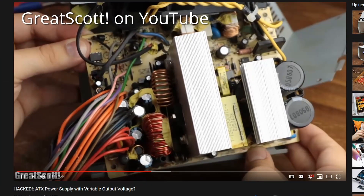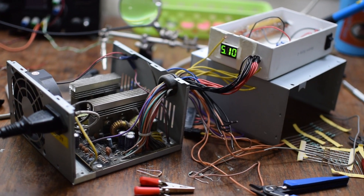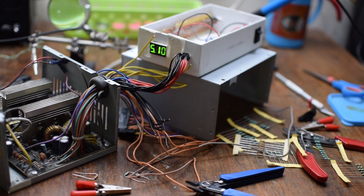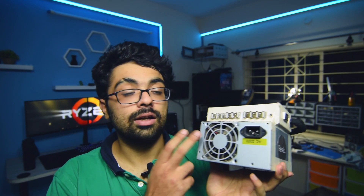So I had to find a different way to get the 4.7 volts up to something like 5.5 volts. I had seen a few videos on the internet where people were messing around with the feedback circuit of the controller, achieving variable voltage at the output. So I decided to try opening it up. Here's a disclaimer: please do not try this at home if you don't know what you're doing. There is live 230 volts inside this thing — it can kill you.